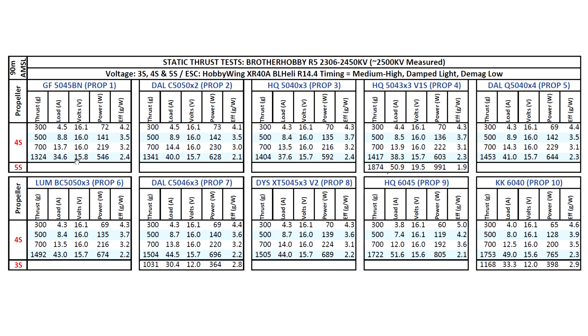Keep in mind most ESCs will have a higher burst rating than what they're rated at. For instance, a 20A ESC may have 25 or sometimes 30 amp burst. The really good ones have about 30 amp burst for about 10 seconds. That's why you can use these motors with 20A ESCs — because in reality the ESC is only going to see over 20 amps for a short time, so it's well within its burst rating.